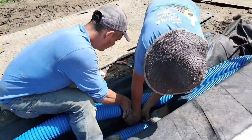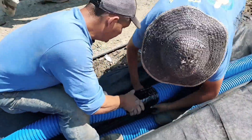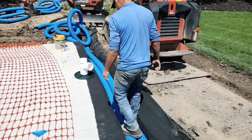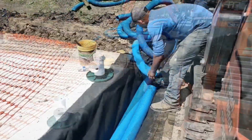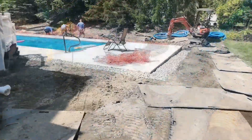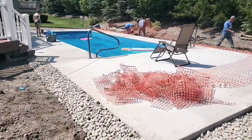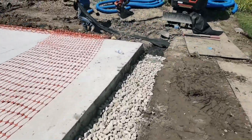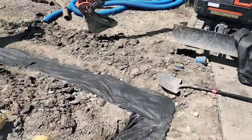This is how you enter a french drain with a downspout pipe — keep that solid pipe next to your perforated pipe. Do not tie it in, because it's going to fill your perforated pipe full of debris, and once those perforations are full of debris, the pipe won't take in water anymore. Always keep those two systems separate.